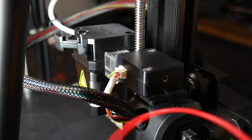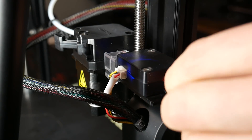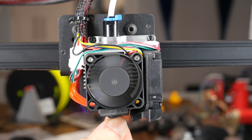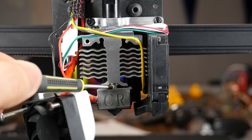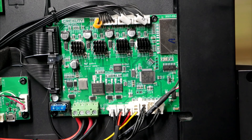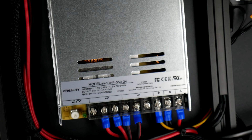The extruder design is exactly the same as the CR6 — swing the latch to take the pressure off, load your filament, and just don't forget to close the latch again before printing. The hot end design is more compact than the CR6, with the same strain gauge for auto bed levelling. The PTFE tube doesn't go very far into the top, but it's not an all-metal hot end as the heat break is quite thick. Inside the electronics case, things look pretty tidy. This is the first Creality printer I've used with this particular 32-bit mainboard, and Creality now appears to be making, or at least branding, their own power supplies.